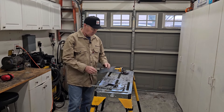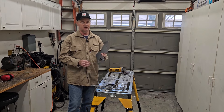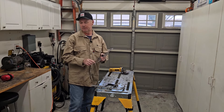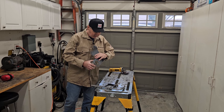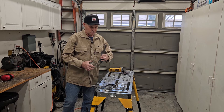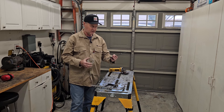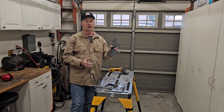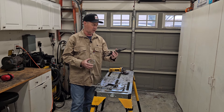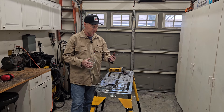Reconfigured the garage a little bit, got my portable welding table out. The cutout worked just as I'd hoped, with the exception of this hole — it's cut exactly to the measurement. I used calipers to measure the jar, but it's just a little tight. I think even if I clean it up, it'll still be tight. So I plan to grind it out to fit and get the threads working, then take measurements on the final hole size and update my drawing in case I ever make another one.